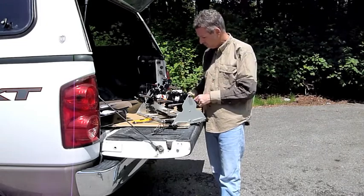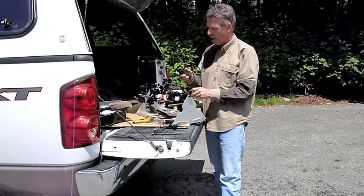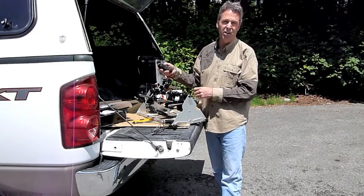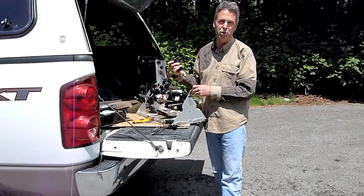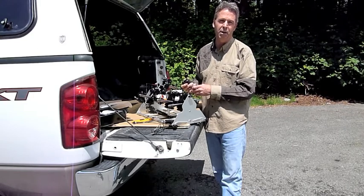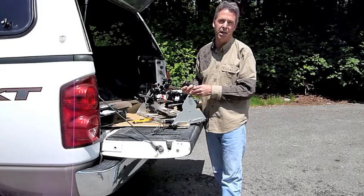You can look in the manual and you'll see that you can drive the servo, and you'll see that it returns to a certain position. That's how you check it — you use the electronics to make sure that it returns to the correct position. That's a little tip on servo alignment. This should be done any time when you're replacing a new servo or just examining your units on a day-to-day basis. Make sure that gap's there.